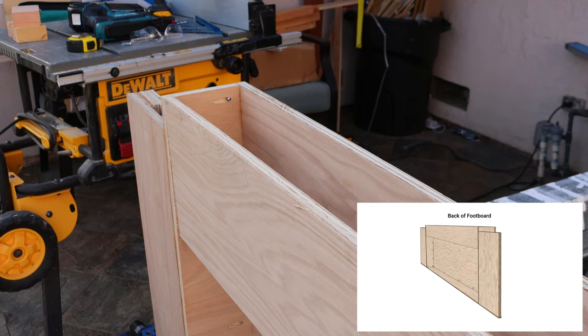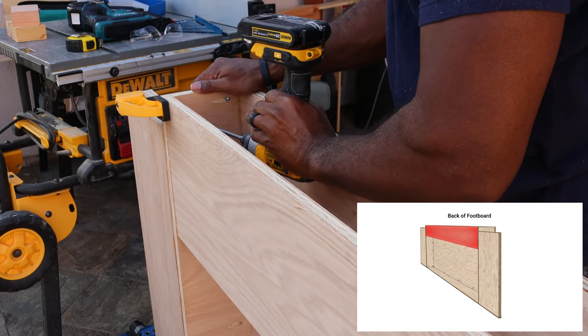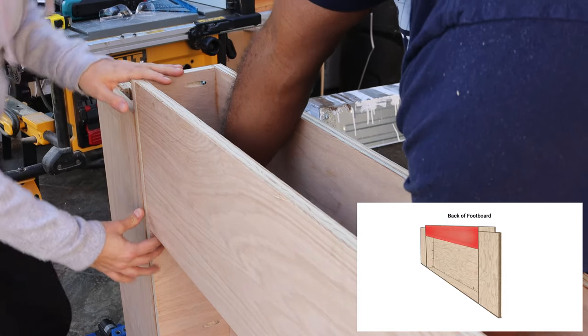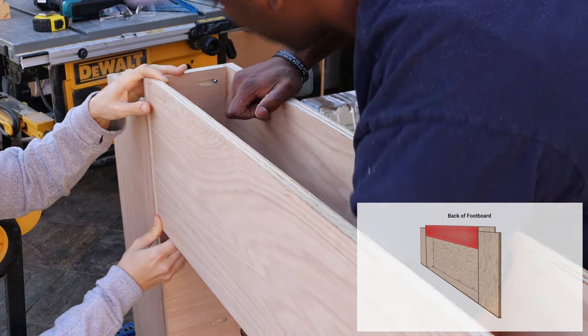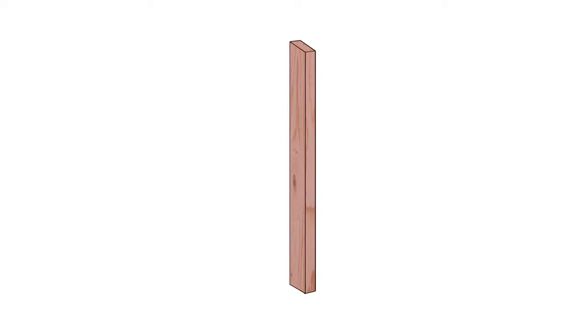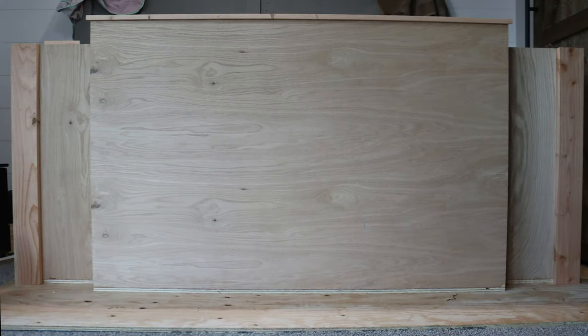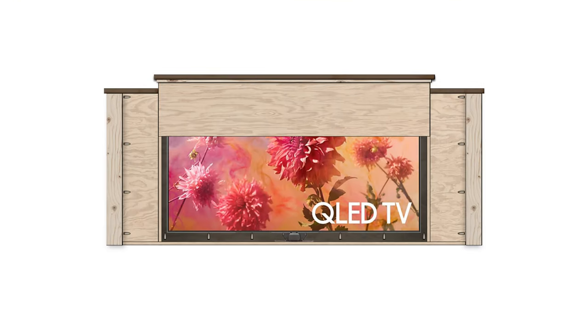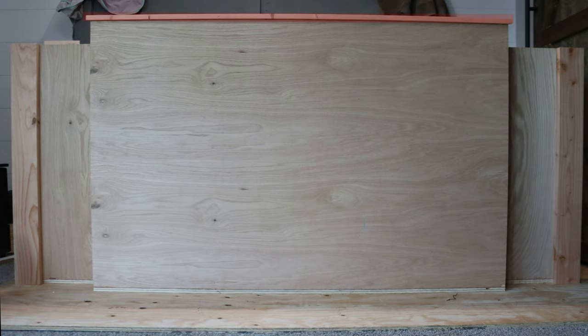I continued using wood glue and clamps wherever I could, and in places where I couldn't use a clamp, my wife helped me out. After finishing with the strip across the back of the footboard, we went on to install the side legs — constructed the same exact way as the side legs for the headboard. We then installed a one and one eighth by three quarters of an inch lip around the opening of the footboard to give us something to screw a piano hinge into, which will allow the mantle to open and close.